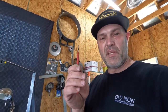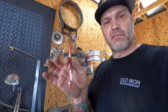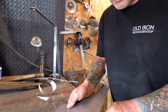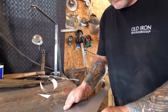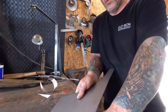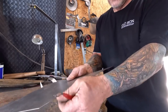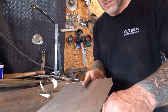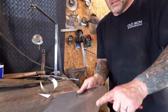I'll have to ream the edges. This thing is a handy little tool. I've had this thing for about 30 years. And it just goes and cleans the edge up, so you don't get that paperclip cut. Look at that. Ooh, baby, look at that. No more sharp edges. Because the shear makes the metal like a razor. And that thing will ruin your day, or my day. Nice.